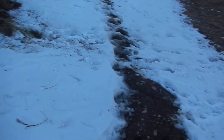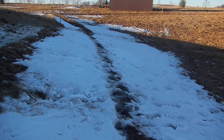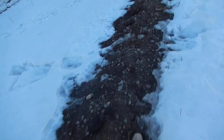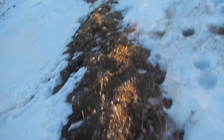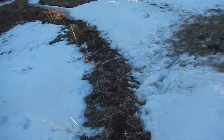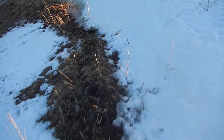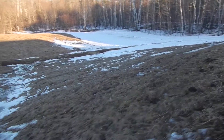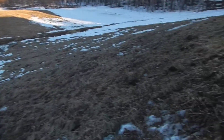There's lots of water in this one here too. We've got kind of a low area here where we need to put in like a finger pond and build up the berm just a little bit more. Things are looking pretty good on this side — we have a little bit of overflow right here, but again this is getting caught by the bottom swale. There's about two feet of water behind this berm. Fortunately, because it's completely frozen solid, the berm isn't blowing out — it's just slowing everything down.